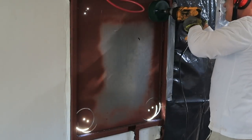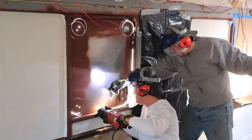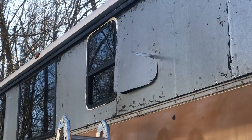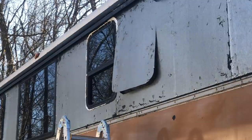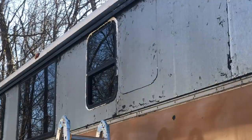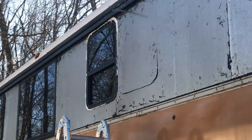We ended up using the same five-inch hole saw we've had for the last week because it's still cutting — amazingly. One of the big changes in the way we work today is instead of using one hole just for the corner, we did two holes with the hole saw. That made it easy to get that curve started, but more importantly, where it was already cut in the sheet metal, we could grab our reciprocating saw and cut straight up the beam with very little problems — although it is so tiring holding that thing shaking you around.